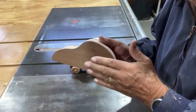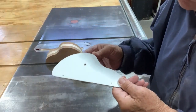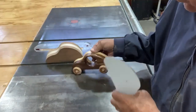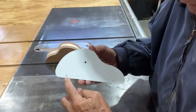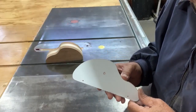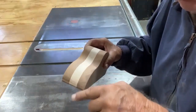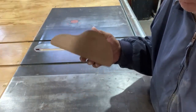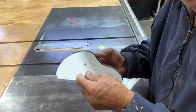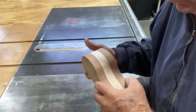This is the one we're going to be demonstrating on the video. I will give you a link where you can download the pattern for these cars. It's a simple cut. Make sure you mark where the center hole goes and also where the wheels go. First, get yourself some wood — inch-and-a-half or glue some three-quarters together — or you can put two or three different colors in the middle. Be creative. Mark it up, glue it together, take the pattern, cut it out, and then we'll continue with the holes.